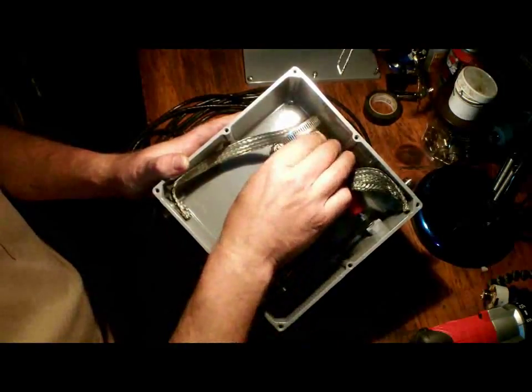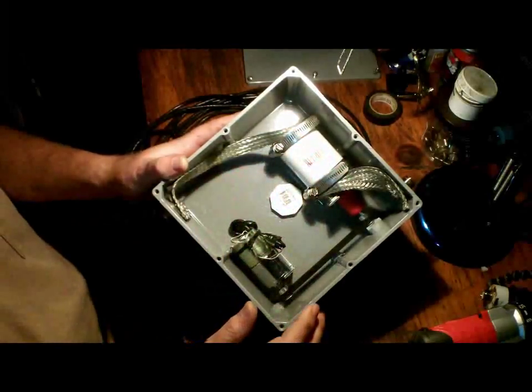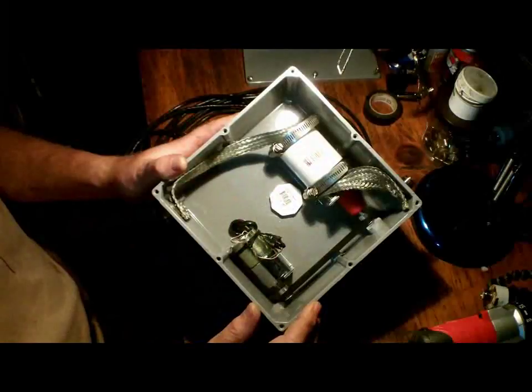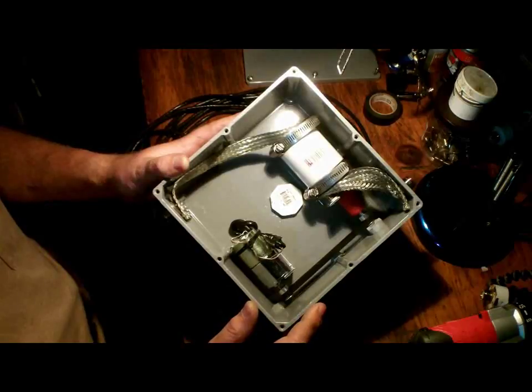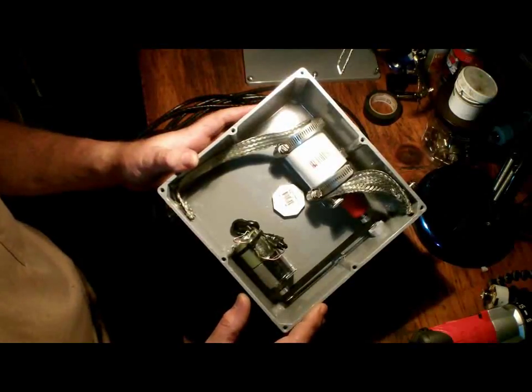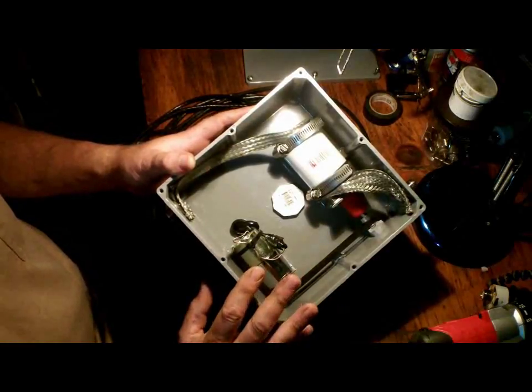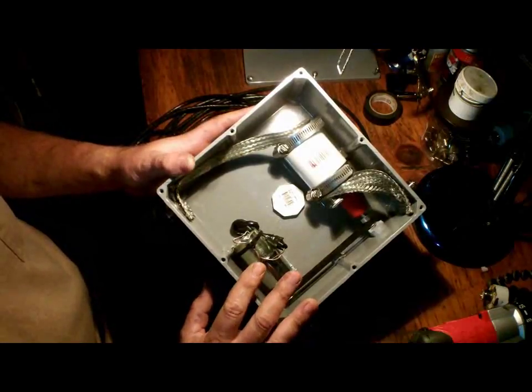The capacitor is really the heart of the magnetic loop antenna, along with the side length, circumference, and diameter of the secondary loop. You have a coupling loop where your coax connects, or some kind of matching system — a gamma match or similar — and then you have your secondary loops, which are the larger loops running around the outside.